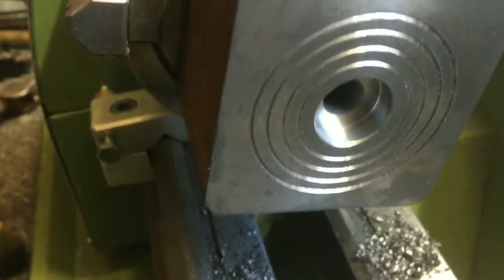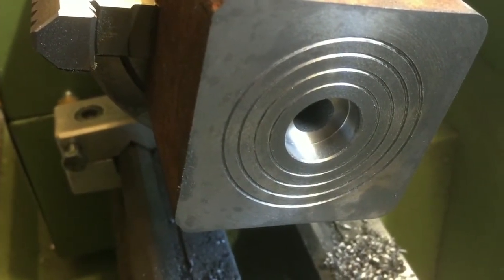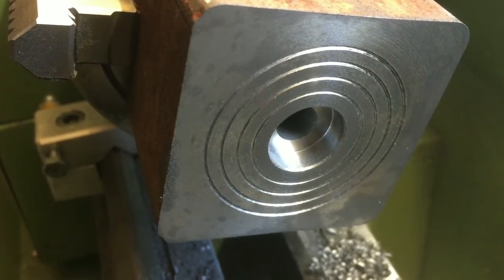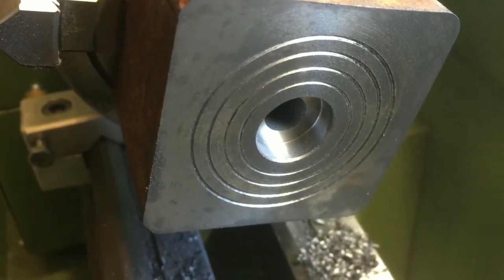And there you can see I've got a series of 4 grooves in the bottom of the post. That won't reduce the surface area by very much, but should I get very small pieces of debris in there, they should work their way into the grooves on the underside of the tool post when it's in service.